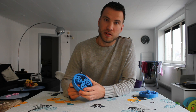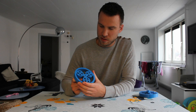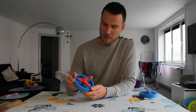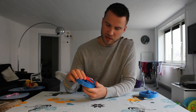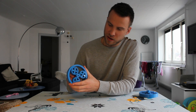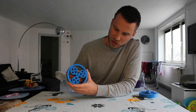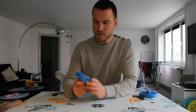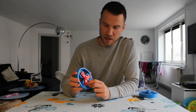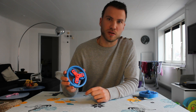The reason it is designed this way — my motivation behind doing this — was that the planets have to rotate relative to the carrier. So as the carrier rotates, the planets inside the gear bearings actually rotate to accommodate that. I could also have just made the pin holes rounded to allow rotation.